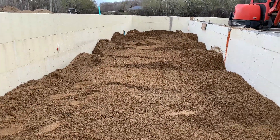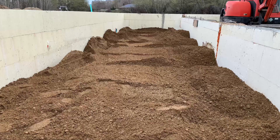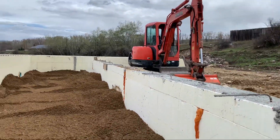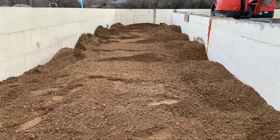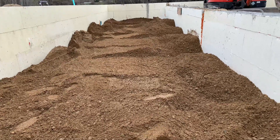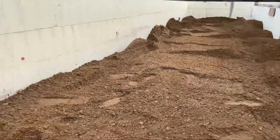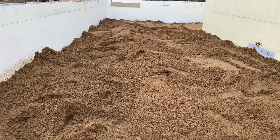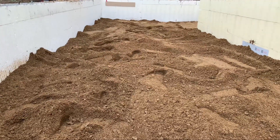When you're compacting your dirt inside your forms and using one of these vibrapack rollers, what I always do is take the dirt, spread it out with a machine, and do my best to spread it out as flat as I can. If you have lumps and bumps, the vibrapack is going to sink to one side or the other and get pushed up against the form. So take your shovel and just spread it out nice and flat so the vibrapack can just roll right over without going left or right and sinking into a hole.